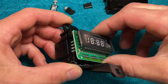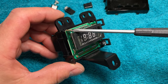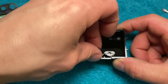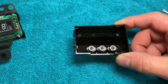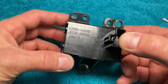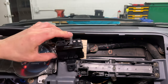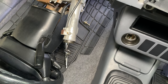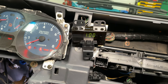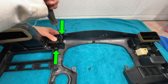Reinstall the circuit board and make sure all four pins go through it. The two small Phillips head screws hold the circuit board down. Stack the plastic buttons and gray rubber pieces into the clear clock housing. Hold the clock facing down so the buttons don't fall out and snap it closed. Now let's plug the clock into the car to test it — turn the ignition key to the on position. And the clock works! Let's put the clock back into the dash trim panel; two screws and it's ready to go back in the car.